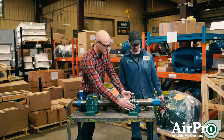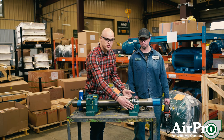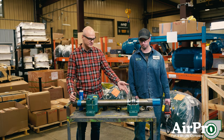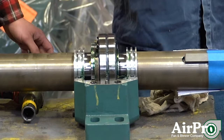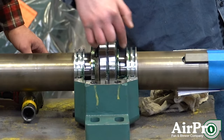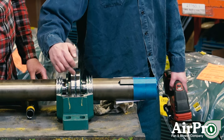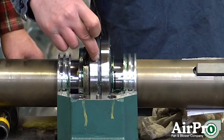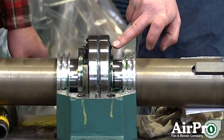If you did have a failure, this is how you assemble your bearings. You get your bearings set in here — it's dry at the moment. Clint is going to show us how you would pack grease into this bearing. We take the grease gun and, in the sides of the block next to the bearing, we fill both sides up to the top.